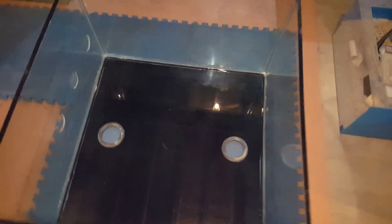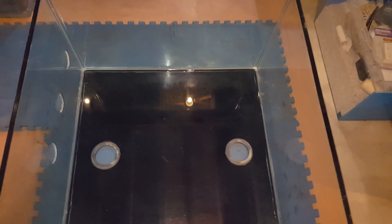And there it is guys, just like that. I put that half-inch pipe — I changed my mind, I was going to do three-quarter but I dropped it down to half-inch — and as you can see, it puts down a real nice bead. We're going to let that set up for about 24 hours, then I'll come back with a razor blade and just lightly take off this little extra line right here. They do make tools out there with a 90-degree angle and a little cut in the corner that you can draw right back. But instead of buying a silicone kit, it's worked out well for me to just use different diameter pipes, put it on an angle, draw it right over, and it makes a nice smooth transition.